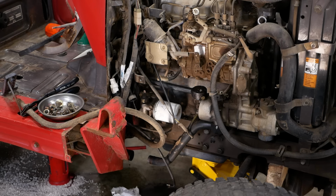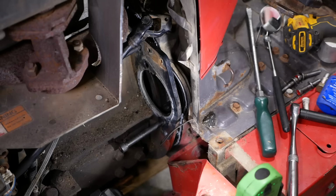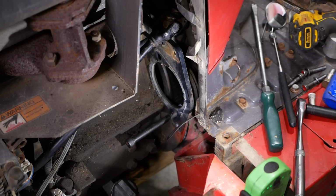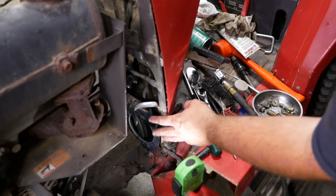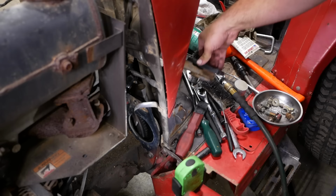Okay, so we just started on the shaft. Oh, is that it? Pretty darn close. I've got all the bell housing bolts in and tight, except for the two bolts through the starter, which do also go through the bell housing. But I think before we install the starter, we're going to adjust the clutch. So it's got way too much free travel right now.